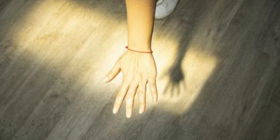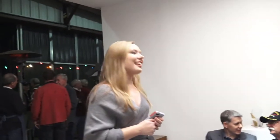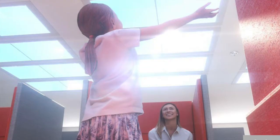In addition to that diffuse light component — which is the sky when you look up through it — there's also a sun component. The sun component is a super bright array of LEDs with an array of lenses that focus that light down into a tight sunbeam and create a rectangular patch of sunbeam on the floor. When you look up through it, you only see one sun, even though there are lots of different LEDs. If you put multiple products next to each other, you would still only see one sun. You could have 50 fixtures in the ceiling, and each person in the room would only see one sun, but every person could be seeing a sun through a different fixture at different times at the same time.